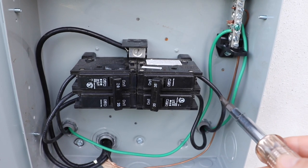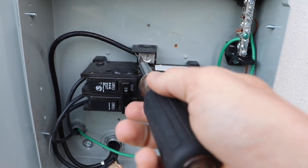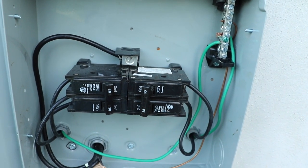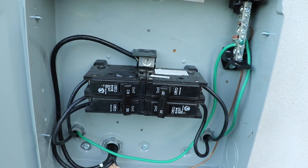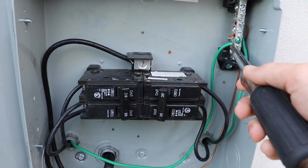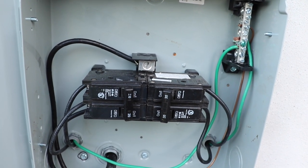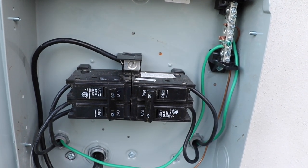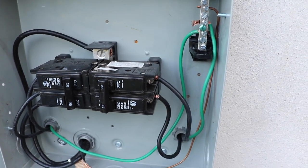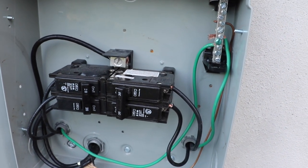This does not pass. This right here is our air conditioning sub-panel. The other thing that we've run into on these is there should be some sort of grease in these fittings, on all the electrical fittings. It's not 100% necessary where there's copper, but in none of our panels were the fittings done using that type of electrical grease. And I'm not 100% sure if you can mix the neutrals and the grounds right here. These are probably grounds, but this one here is just a mess. Mainly because these wires were cut as they were stripped, so the whole thing has to be cut back and rewired. Hopefully we have enough slack here to get it to work.